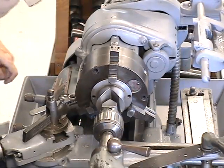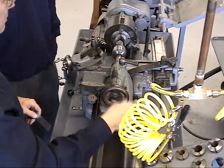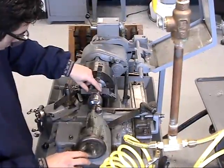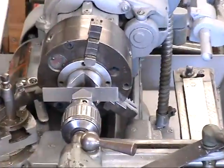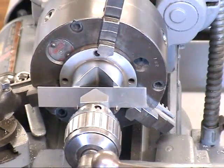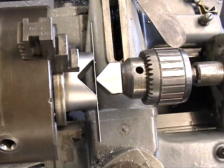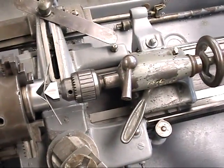Here we see the tooling mounted in the lathe and show the punch moving as the tailstock lead screw is rotated. Notice that the displacement of the punch is determined by the rotations of the hand wheel on the tailstock. The bend angle is determined by the displacement of the punch relative to the die, but will also depend on the thickness and constitutive properties of the sheet.